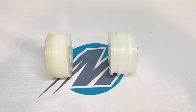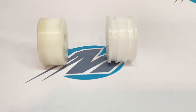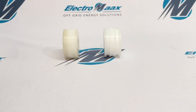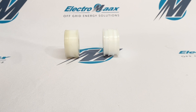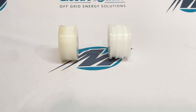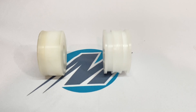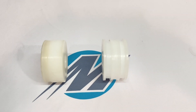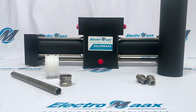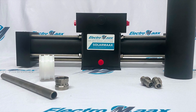The pistons. The original is a one lip design. We have redesigned with a new dual lip. This has increased the performance and applies the pressure to double the surface area, making the wear 50% less on this particular part. The design of the cylinder-piston combination ensures the simple, inexpensive piston lasts twice as long and is the only part that will ever wear. To change the piston, pull off four nuts, remove the end cap, and the old piston will slip out and the new one will go in place. Put it all back together — very simple.